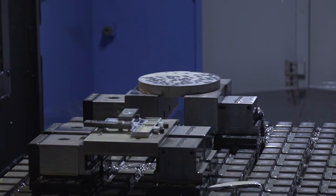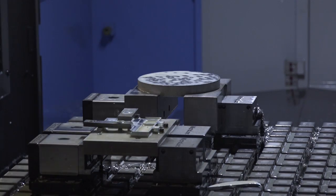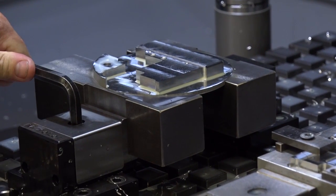We're contract engineers — we never know what the next job will be, so by covering the whole bed we've got all bases covered. It's important to mention that the Micro Lock is a flexible work holding system. Sometimes engineers look at it as a production tool, but you're saying quite the opposite — you like it because you change jobs quickly. Yeah, I've got some guys here that do 12 to 15 setups a day. We can put soft jaws or hard jaws in the Micro Lock system — you'll see when you have a look in the machine we've got machine jaws to suit the components we're making today. Very flexible, quick changeover, quick setups, and accurate as well.